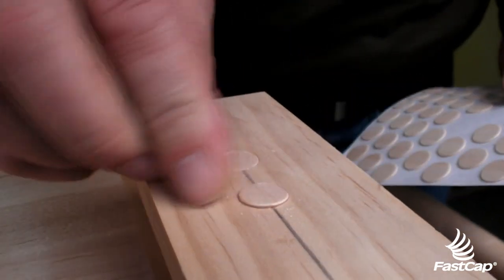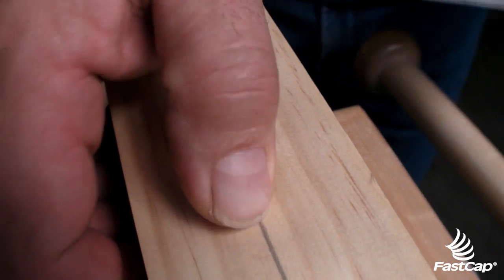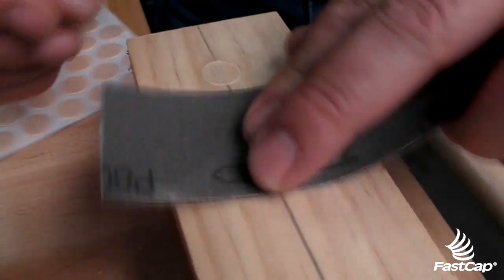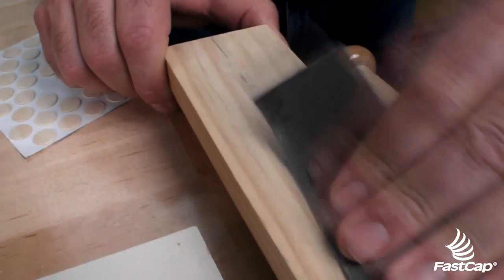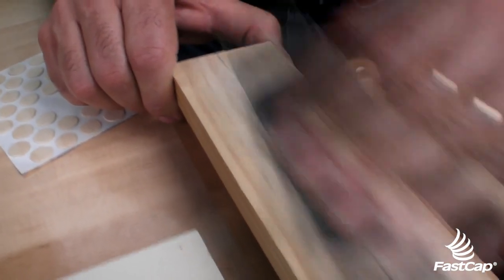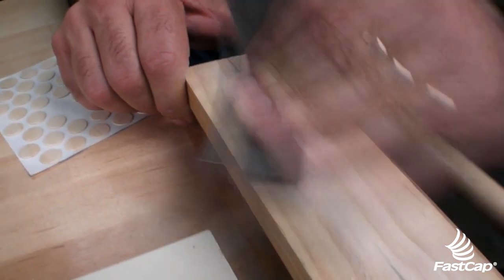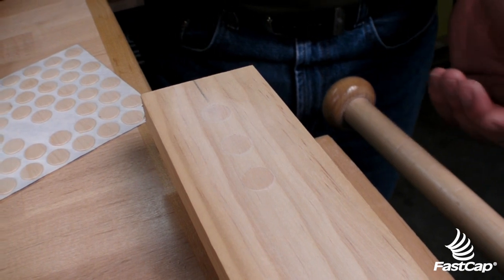We want to line the grain up too. And there you go — it's perfect, right along the top. Now you can take a piece of sandpaper and sand it. You can put a little glue in there if you want, and that glue will fill that crack — any little bit you have in there — a little 2p10. So you have a beautiful job where you have a camouflage screw. It's very easy with the flush mount drill bit system.